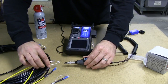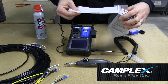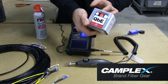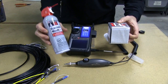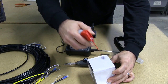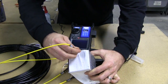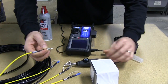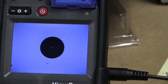The next step is to start with a fresh pad — you don't want to bring any residue from previous cleanings. What we're using here is the Chemtronics QBE wipes with their Electrowash PX solution. You just do a little dab in a corner so you have a wet area, and three times you're going to go across from wet to dry. Not too much pressure, but enough to clean the residue off. Give it a little bit of time to air dry — it doesn't need much. Then do a follow-up inspection, and you should see a very clean fiber optic cable.